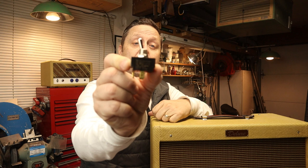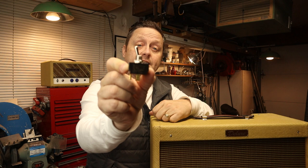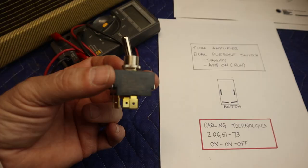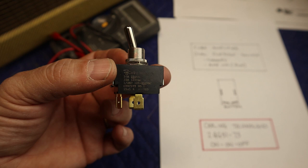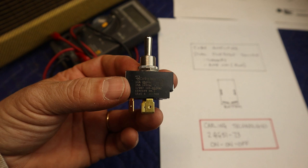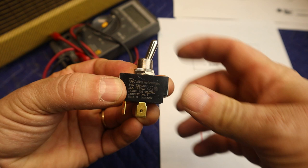We're going to do that with this unique little switch here. It's a two-in-one switch, so I'll run down how it works and how to install it. This switch is an on-on-off switch. In the off position, when you move to the middle position it turns on the transformer that heats up the tubes, and when you push it all the way forward it applies the B+ to the tubes and puts it into the run position.